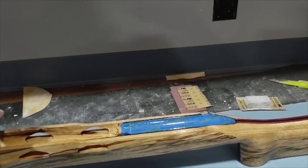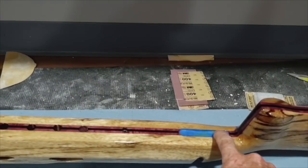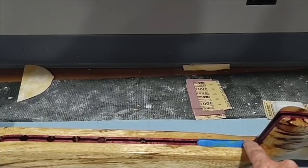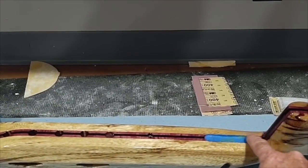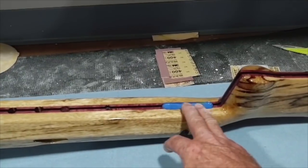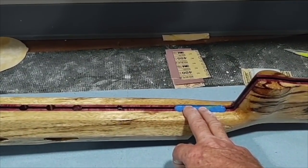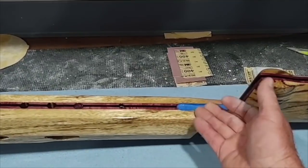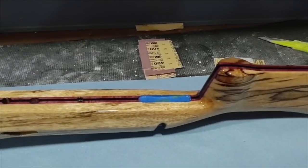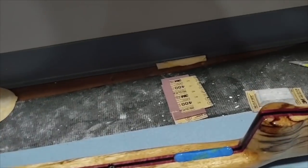The other thing I'm going to do today is remove the masking from underneath, because there's a buildup of finish around the edge. So I will carefully cut this masking out, make sure I lightly sand around the edges so we don't have any sharp edges or anything that can peel the finish up. Then I'll re-mask it for the final three coats. Leaving this on can get a little touchy when you're peeling it out because you can actually lift the finish off due to the buildup on the tape, so it's a good idea to cut that out, re-mask it, final few coats, and call it good.